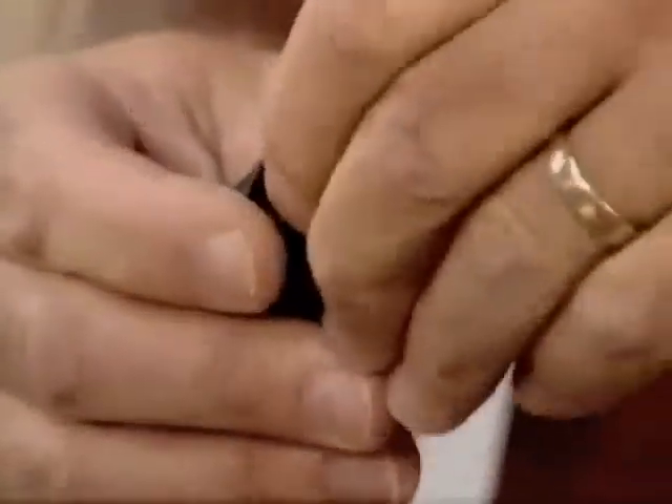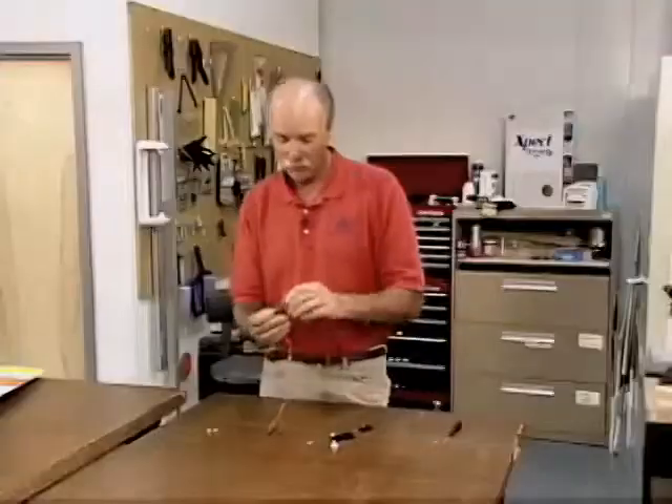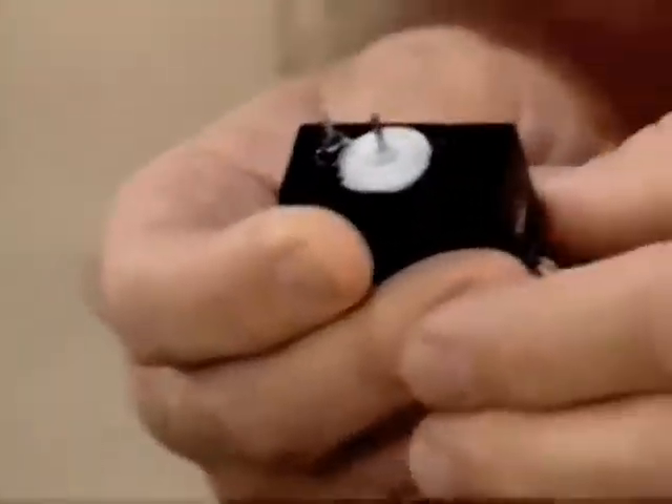Make sure you precisely clean each gear, get that lubricant off, and remove any debris or broken teeth that might be lodged in there. Remove all of the gears. When you get to the bottom one, you can remove it or leave it — it can be inspected right in the case. Take a good look at each gear.